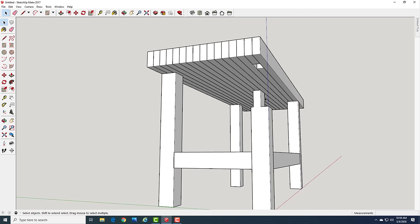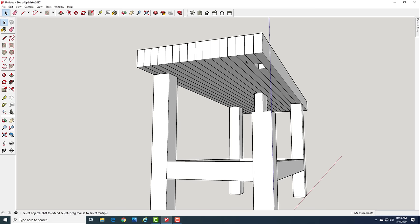And this is a pretty easy project to make. We've actually built this whole thing so that it's simple to make. You would probably just glue all of these interior 2x4s together, and maybe just glue this one on. Then you'll cut these, put them up in place, then you can glue this one on, then you can glue the outer one on, and you don't actually have to go through the trouble of cutting a mortise. So this is a pretty cool way to make a mortise in a tabletop.